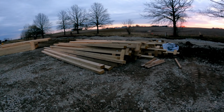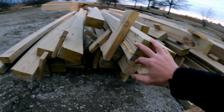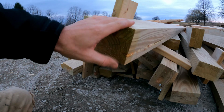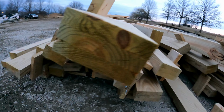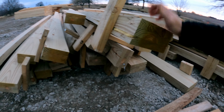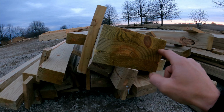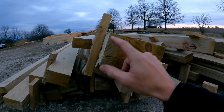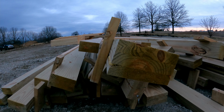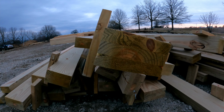But also, just to show you, they're using these laminated, they call them ply, but I think they call these 3-ply. These are 2x8s, probably glued together, maybe screwed and nailed, but you actually get a lot of strength and rigidity out of that ply concept. And another aspect of that too is, according to my pole barn builder and other people, when they pressure treat these things, you get more penetration of preservative in each one of these 2x8s than if it were just a regular old 4x6 or 4x8. So that's pretty cool. Well, the boss is calling in here, so we're gonna talk to them.